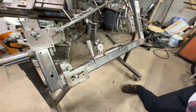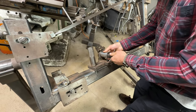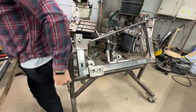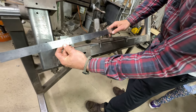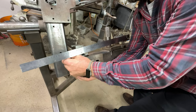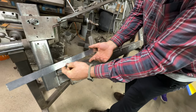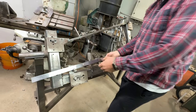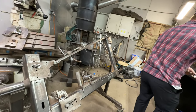To put it forward and backward — your chain stay length moves. I made a ruler for it just to make measuring a little bit more simple. Put the bolt in there and it gives you the center, which is your bottom bracket or chain stay length. It slides — this fixture will go as set up to about 12 and a half inches short. Any closer and I'm getting into really custom, non-production stuff.